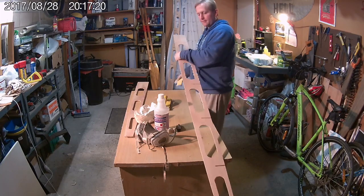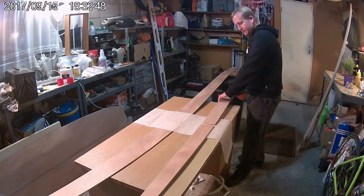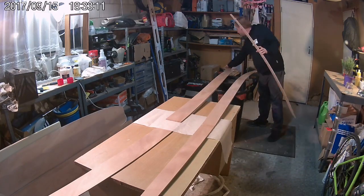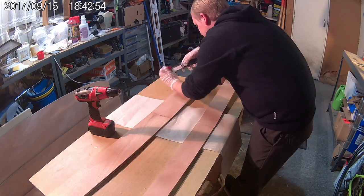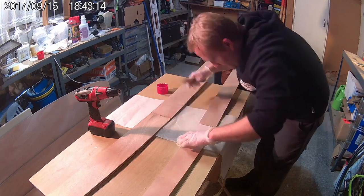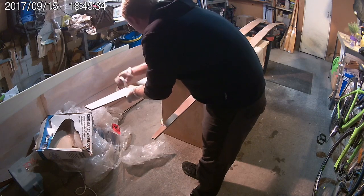Once all of the edges have been cleaned up, we can now start joining together the shorter panels to create full length panels. Here I will be working on the side panels of the board. I have both sets of side panels laid out on the desk with some waxed baking paper in between them. I'll tape the panels together to ensure that both sets end up exactly the same when joined — the baking paper prevents them from sticking together. Apply a small amount of epoxy glue to the edges of both panels to be joined; I like to use epi glue for this, but even some epoxy resin with glue powder mixed in will work. Push the panels together ensuring that the edges line up. I'm taping the top set to the bottom set to ensure that the edges match up and both panels end up being exactly the same, ensuring a fair and even shape to the board when it's finished.